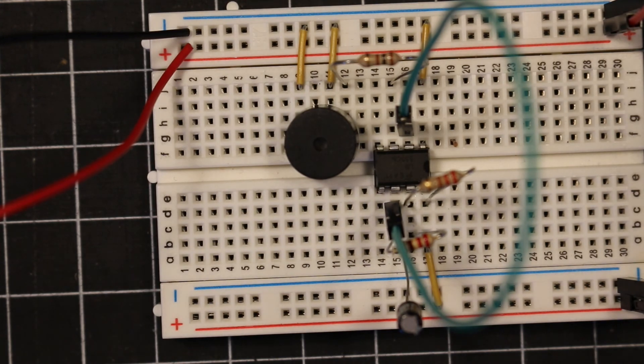So that's still a little bit clicky, but it's doing something different. I suggest you go ahead and play with these and see what sorts of sounds you can make with your buzzer. Try the 100 ohm resistors as well in different places, and try combining those with the 470. It probably was that our 100 ohm was too far off from our 2.2 kiloohm resistor and our wave was too wonky to be useful. So experiment and see what you can find out.